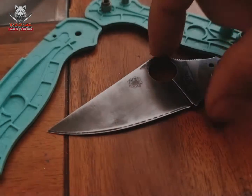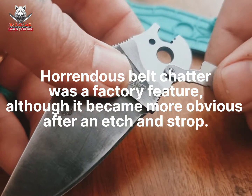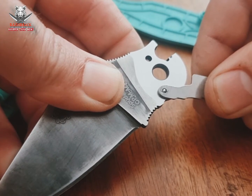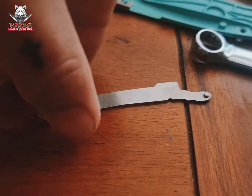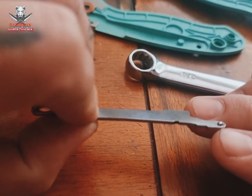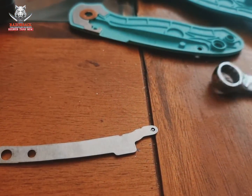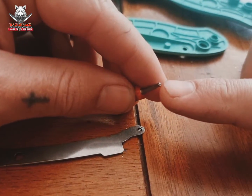So I've got the gauge at the tip of the blade right there just to exaggerate the movement. If you chuck the compression lock, the lock bar here, you can see just how much play there is in that detent ball. So obviously it's how far that detent ball's set that's causing the problem. It did seem that sloppy. I set detent balls all the time, but there was so much slop in this one. I almost wondered whether or not the hole had been drilled in the wrong place, or if the hole had been drilled oversized, or what was going on with it.